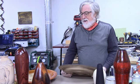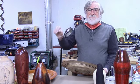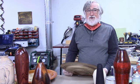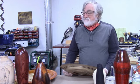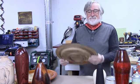And then I had to go back, and I found that I can do repairs in shellac finish by putting some more in and then rubbing it out, and that's what I did. I had a few little goobers in the finish that wouldn't go away, and I figured it out. Yeah, the French polish effect. Yeah, but it just takes some patience and sit down and turn on the music and play along.